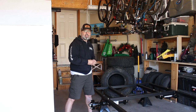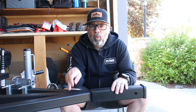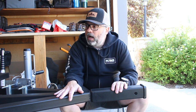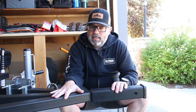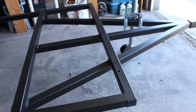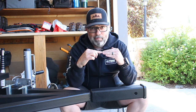At the front as you'll notice I have it in a triangle format. By the way, this is two-by-two by one-eighth wall welded square tube - strong enough and sturdy enough. The reason I put this underneath the main chassis is to give it a lot of tongue weight strength. I didn't want any flexing to happen because on the first trailer I did a single bar going all the way to the back and it bent, so we had to weld a gusset underneath the center bar to keep it from flexing any further.